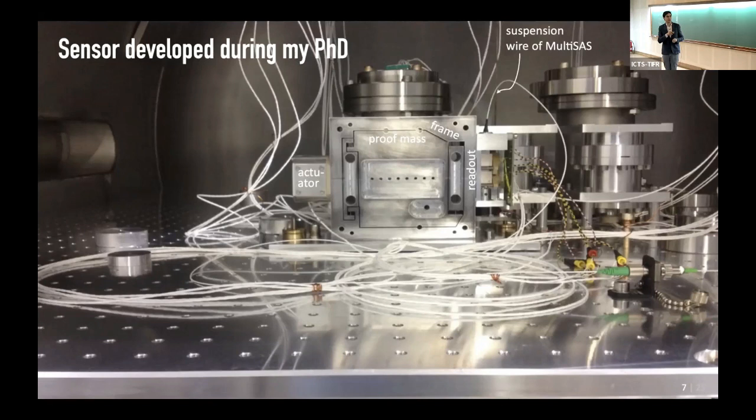So then you have something suspended inside a frame. The frame you put on the thing whose vibration you want to measure — in our case, hopefully rigidly attached to the lunar surface. Then above the resonance frequency of this suspension, this is now an inertially suspended mass, so it will not move exactly with the frame. If you take a differential measurement between the proof mass and the frame — in this case with an interferometer — then you have a vibration sensor. That's the essence.